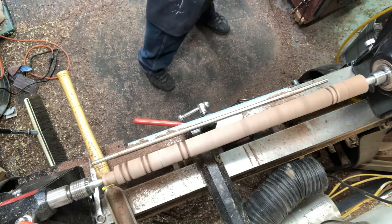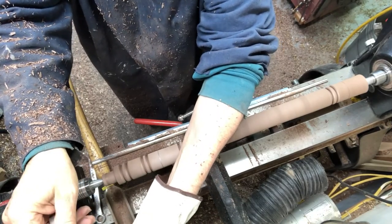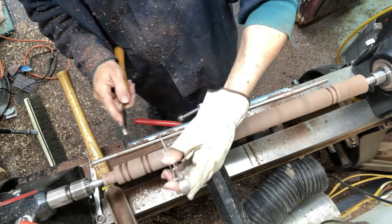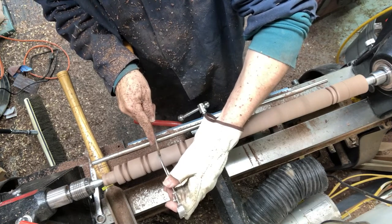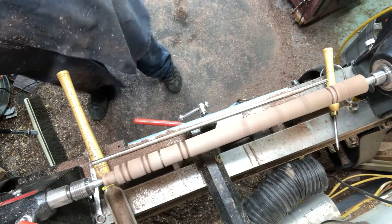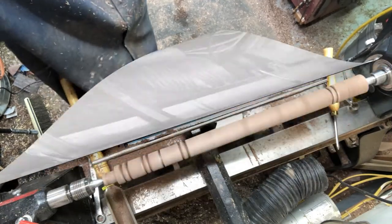Once I'm satisfied with the beads, now I'm marking off what I'm calling the milk bottle shape. What I'm doing here is measuring the bottom of the cove using the caliper. Now I'm getting ready to make a cove here, and there are different tools you can do this with depending on your skill level.